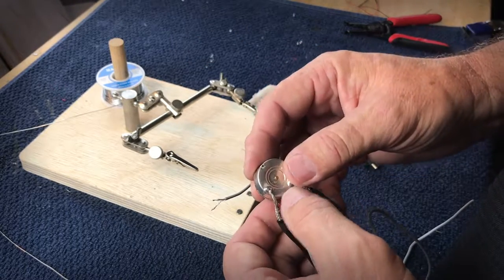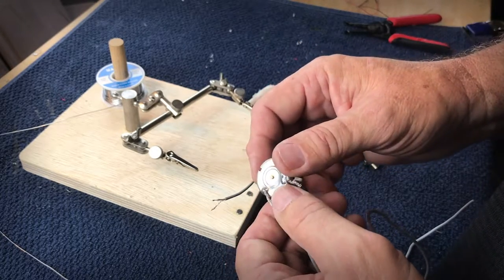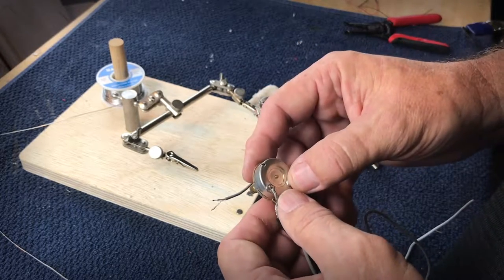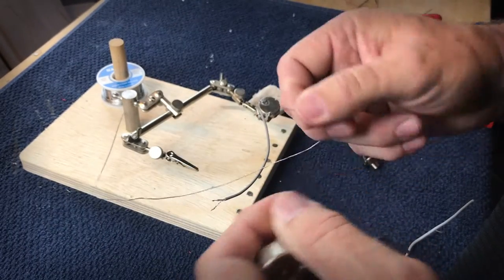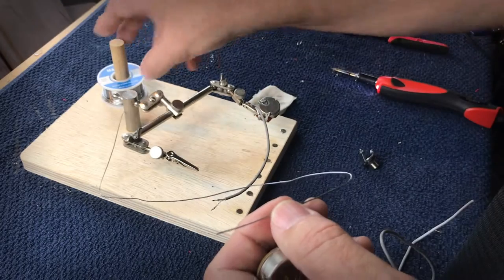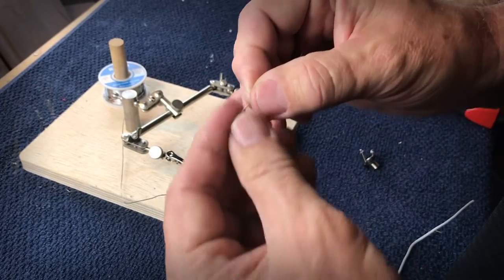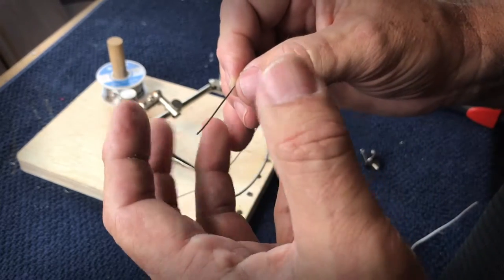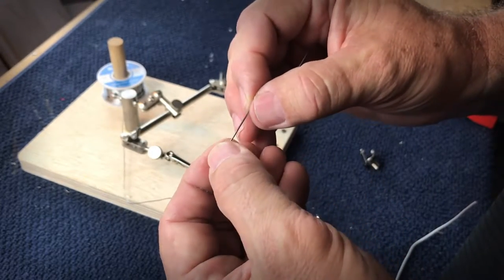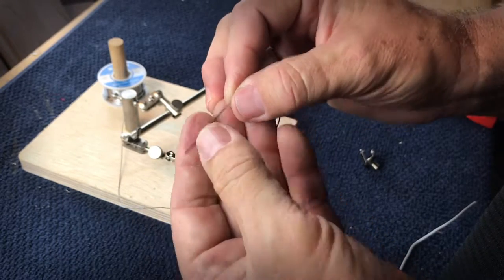I've been doing a lot of soldering through all the years, even before Cigar Box Guitars. And this kind of works for me. Let me show you what I do. First thing we need to do is talk about solder itself. You buy it on a spool. I like to buy the 0.033 small diameter solder. Works out really well. The larger diameter solders are just too cumbersome and they don't tend to work well for me. So I stick with the small stuff.